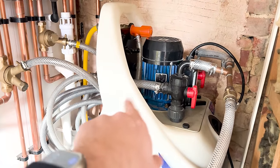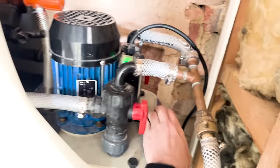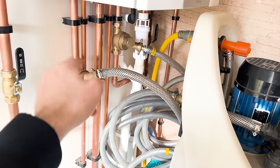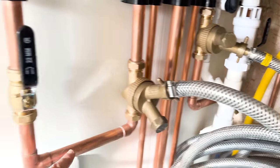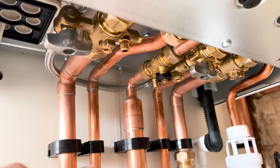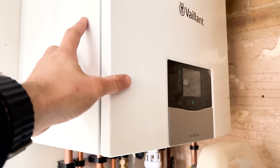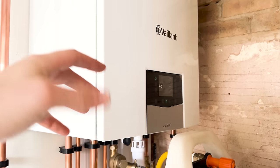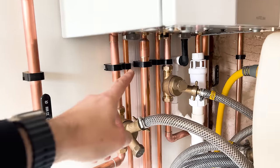I've got this set up now — you can hear it whirring away around the rads. I've got some X800 in there at the minute and I'm just circulating that through the rads, changing direction every now and then. When I move the lever it's either going one way or the other. I've got my Spirotech flushing adapters on and essentially it's going up through there. It's isolated at the boiler so this dirty water is not going into the boiler. What I love about Vaillant is when it's isolated you can top the pressure up inside the boiler, tricking it into thinking there's pressure in the system — then you can have hot water, which is what happened overnight.